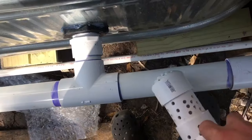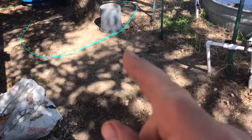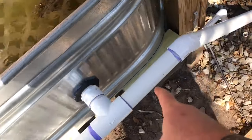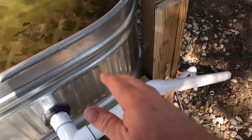When we have a drain, the larger the mouth relative to the pipe's capacity shifts the pressure in the same direction - but instead of pressure out, we get suction in. In a system like this, we don't want high suction, so we want two to three times as much opening as the pipe's capacity allows. Think about it in reverse: a half-inch garden hose attached to a two-inch pipe - when the water goes into that pipe, it just kind of drops out of there.